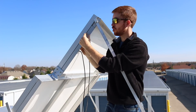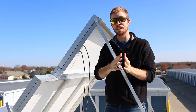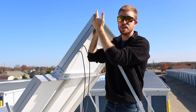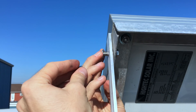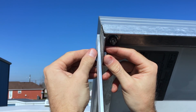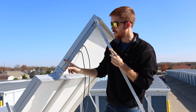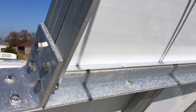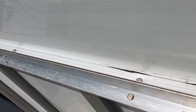These are two by two aluminum angles cut to fit — I had the steel shop cut them to the correct measurements. I tied them all together with stainless steel bolts from Home Depot. All the hardware is stainless steel so that when it's exposed to weather it won't rust like normal steel would. I've got it mounted in multiple spots and reinforced at the angles where the single panel aligns with the other three panels, reinforced through both the solar panel frame and the custom aluminum frame.